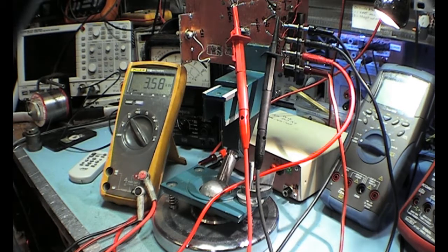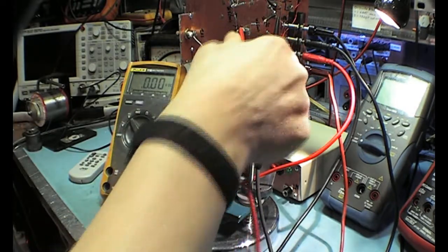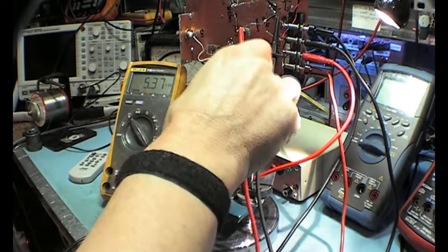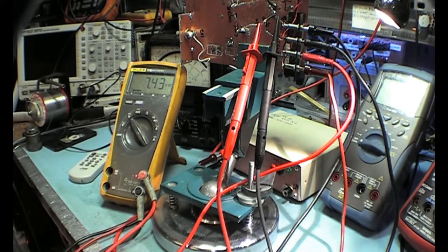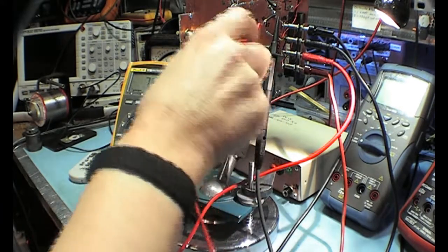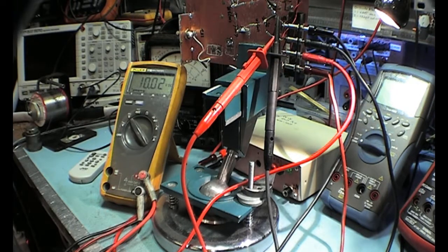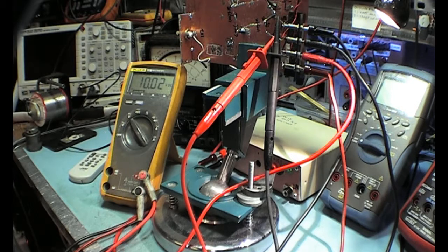showing the wrong values. So in this case, if we go up to the range, we go to here, we should have 6.16 volts there, and we are only measuring 5.37, and that goes up to the 7.34 instead of 9.35. And if we go all the way around, we are now measuring over the resistors parallel to the source, then we see it's again 10.2 volts. So the 2 is also a fault of the Fluke.